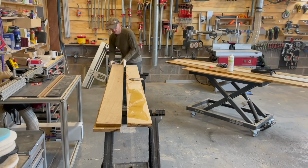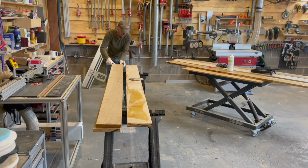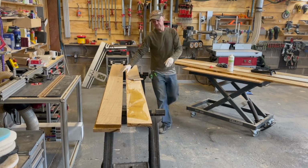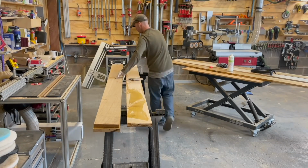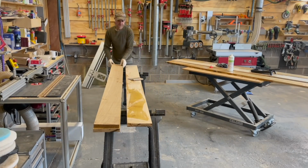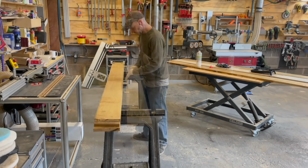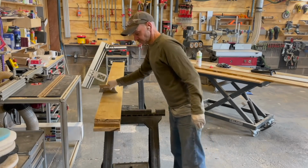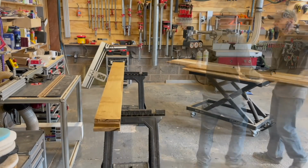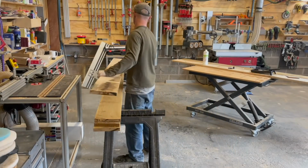So this is a kind of D3 expanding foamy style glue, and to be perfectly honest, this is not what I like to use, but at this stage I was trying to use up all the old glue I had for my own laminations. I much prefer using a resin or a non-foaming white glue or even Titebond, but this is good and it is a quick set, so sometimes good for the job, but I don't like to clean up.